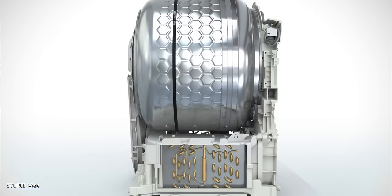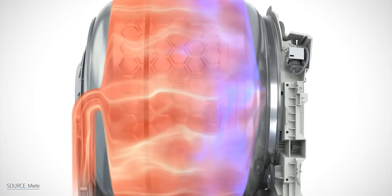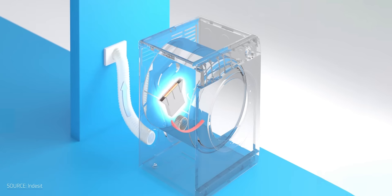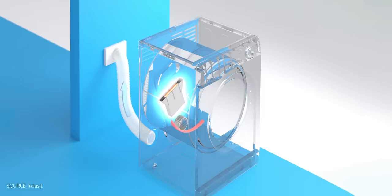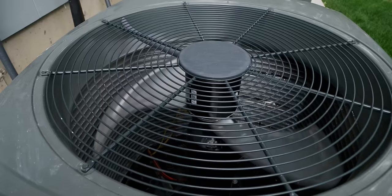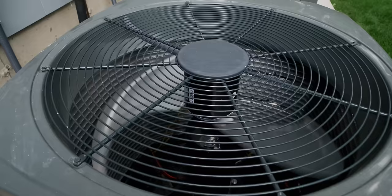That hot air helps to evaporate and remove the moisture from clothes that you're trying to dry. In a typical dryer, this hot moist air is what's vented to the outside of the house. You need to keep pumping in hot, dry air to fully dry the clothes. This creates a bit of a problem, because as you're ejecting that hot moist air from the house, it has to be made up from somewhere else — cooler outside air seeping in. The dryer is not only drying your clothes, but costing you more money by forcing your HVAC system to work in overdrive to recondition the house from that energy loss. It's a one-two punch of: why are we doing it this way?